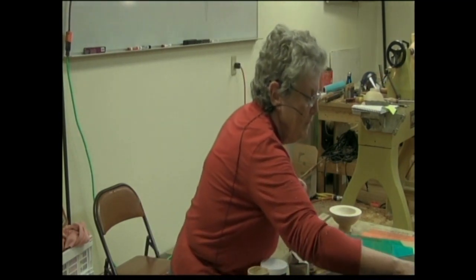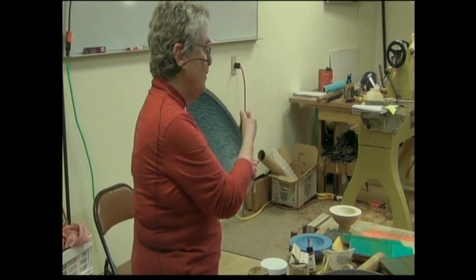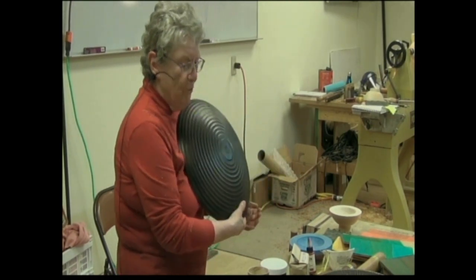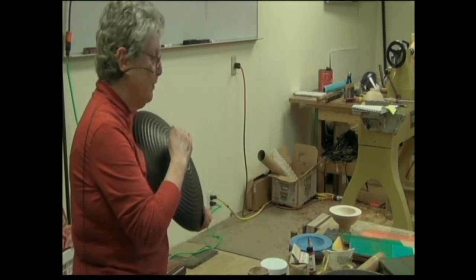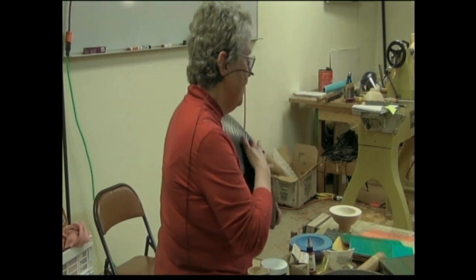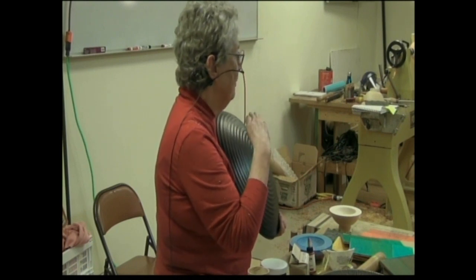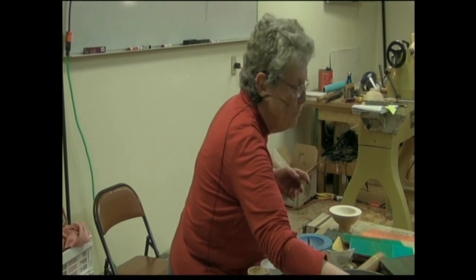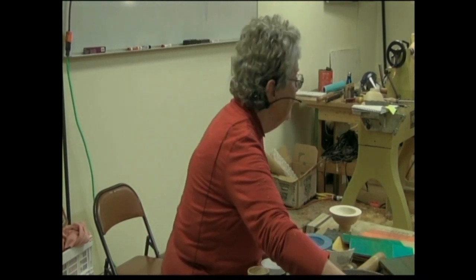So this piece is a mixture of carving with a die grinder, burrs, and then doing the black. And one of the things I learned from a painter friend is I don't just put on black, it's layers. So I'll burn, then I add dye, and then I tint the oil. So you get much richer color by layering colors. I only learned that by going to painting class or from artist friends. And so it adds much more depth to the piece. And then this is milk paint in the middle.